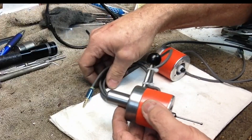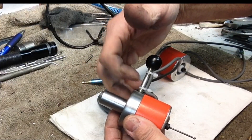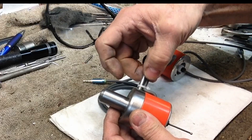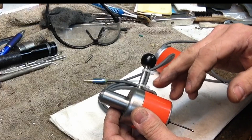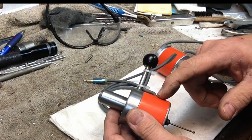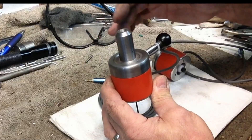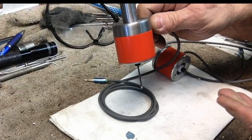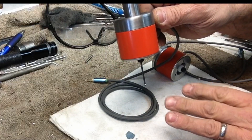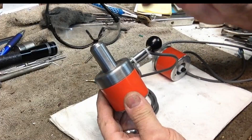This is the one I've actually shown the assembly on. I've put a little stub handle on here with a little ball, and I've zip-tied it. That's actually working as a strain relief for the cable which I've epoxied on the inside of the body. It also gives me an index point so I put the probe into the spindle the same way every time, taking care of any variation in how it picks up the probe tip.